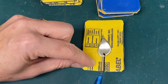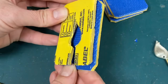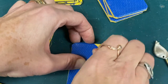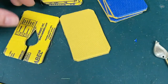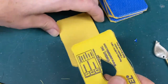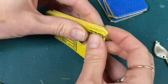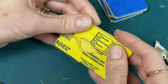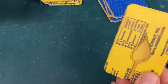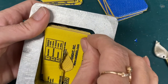Prepare the layer right below it by removing the blue plastic side and sticking them together. I like to assemble my rubber mold outside of the aluminum frame, but if you prefer you can assemble inside the frame — things may be a little bit easier to hold together. Always remove the coating before putting layers together, otherwise it will not vulcanize.